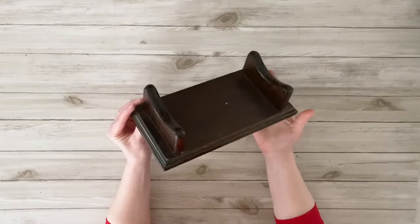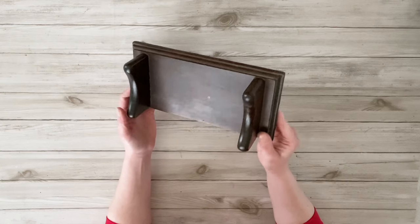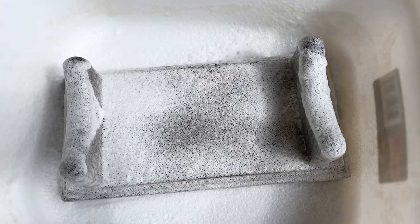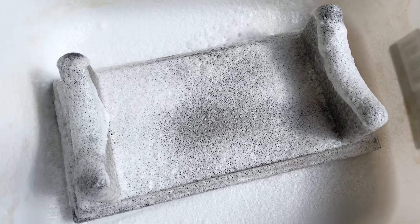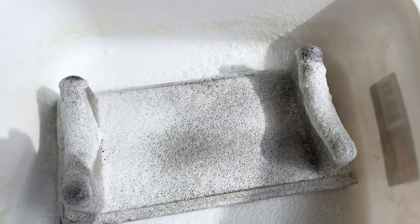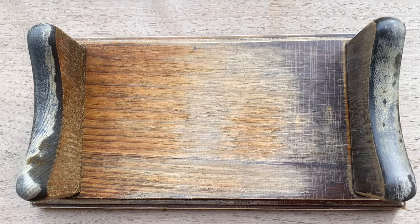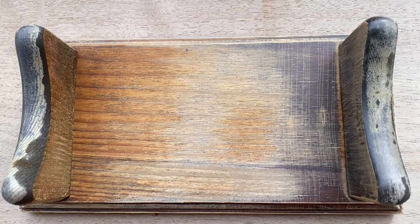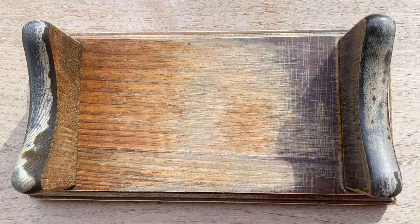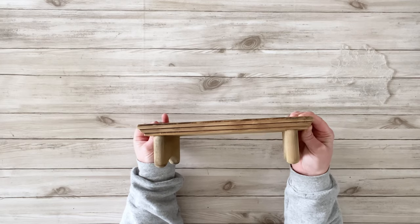Because the oven cleaner hack worked so well on my box, I decided to try it on this darker stained little book rack that I found at the thrift store. I repeated the process using the oven cleaner — this time I used an old dish pan since it was a smaller piece — sprayed it really good and let it set until it was dry. Because this was a darker stained wood, I wasn't sure how well this would work, but once I rinsed and scrubbed it, it didn't work quite as well and there was still a lot of that dark stain left. So I repeated the process a second time, and once I let it set in the sun, this is what it ended up looking like.